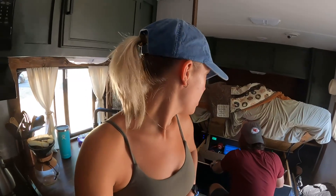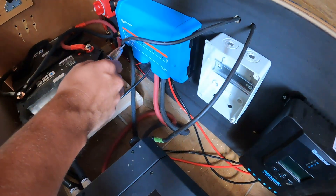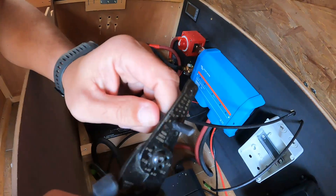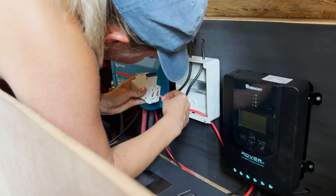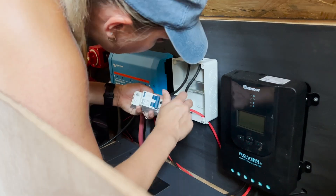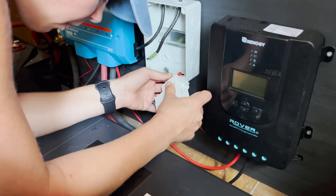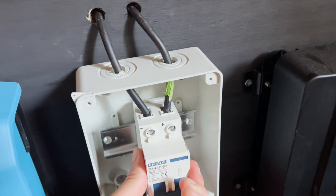Round two — it's the next day. Got the solar panels covered up again, and now we're getting power disconnected to everything so we can install our little breaker. Here we're just checking to make sure the wires are safe before we start working with them. Once we got those trimmed, it was time to connect them into the new switch. Just checking to make sure everything is secure, since that was what caused our solar issues to begin with — one of the wires was not securely in place.